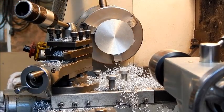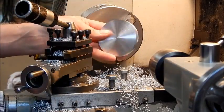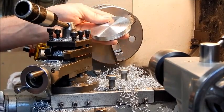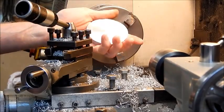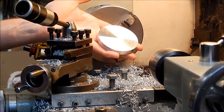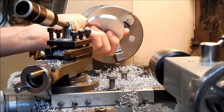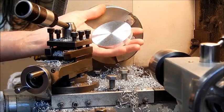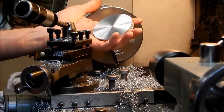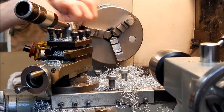I won't be doing that in this video, but this is just to show you how easy it is to make a perfectly good blank out of really good quality aluminum — you wouldn't do better if you bought it. That horrible looking piece of aluminum that came out of the tin becomes this. Okay, we wasted quite a bit and it wasn't the best pour in the world, but it was more than good enough. There you go — cut your own aluminum gear blanks, and they cost you a bean. See you next time. Cheers.